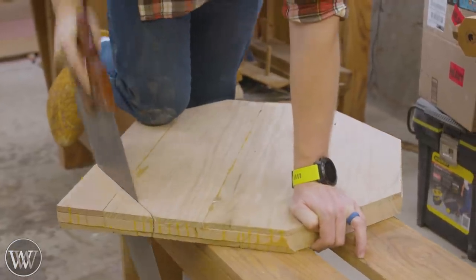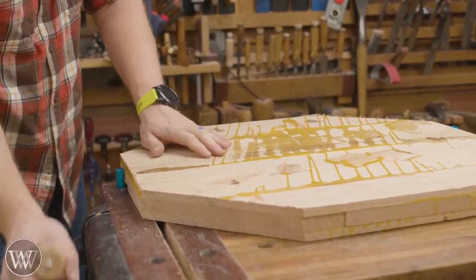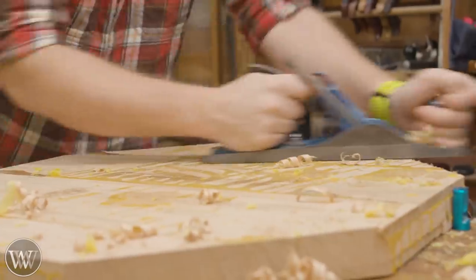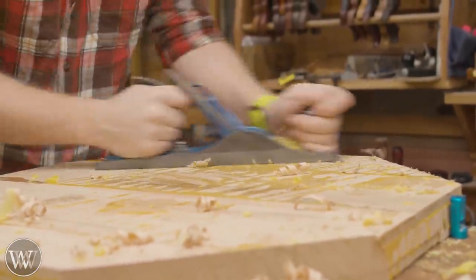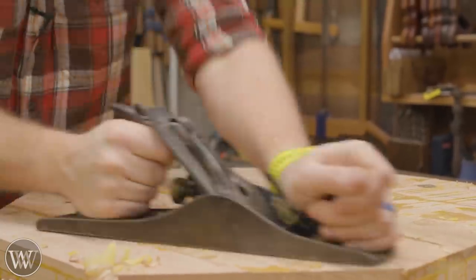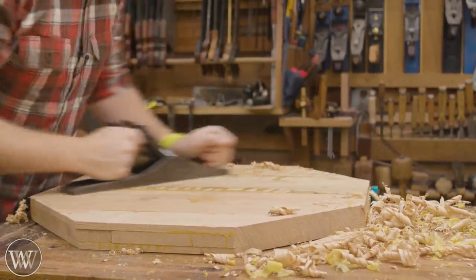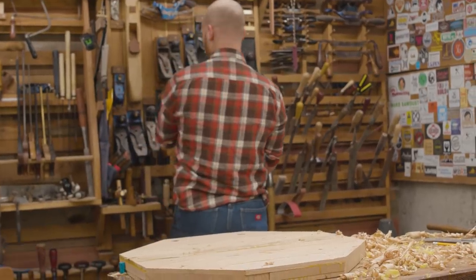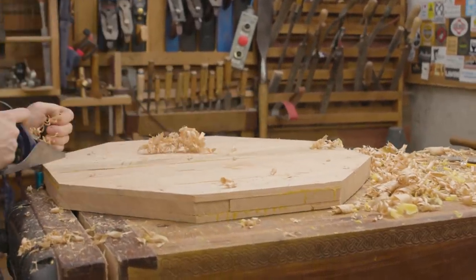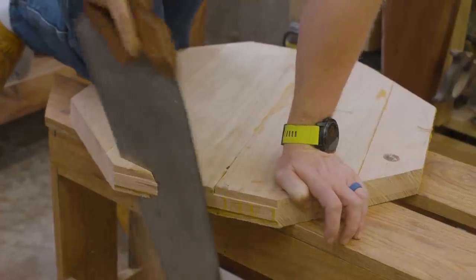I cut it into an octagon and chopped off the corners with a chisel, but found I really needed to take off more material — it was a lot to remove, and the reversing grain made chisel work very hard. Before going any further I wanted to flatten both sides. There was a lot of glue residue and some unevenness, so I used a scrub plane to take a thin layer off, then a number six to smooth and flatten it out, followed by a number four-and-a-half to get a really nice clean surface.